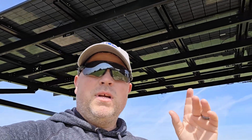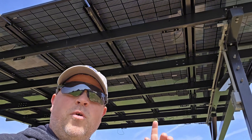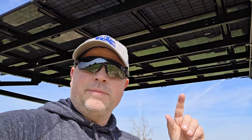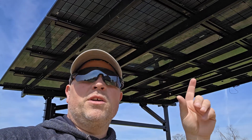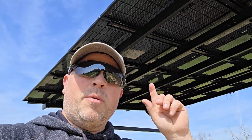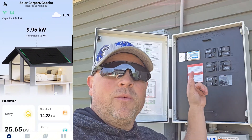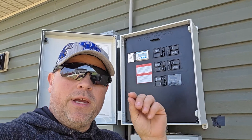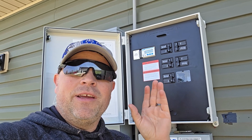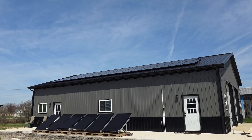This process is still in the works — I'm not 100% complete, I still need to come back and put the bird mesh in and tidy up the wires on the microinverters. But this is what the underside of the solar carport looks like with all the microinverters installed and actually turned on. These solar panels are 415 watts by Sirius Solar, sold from Signature Solar. So far they're performing perfectly — even on a cloudy day I've seen them produce up to 10 kilowatts, which is just over the STC rating of the solar panels, so there's definitely some bifacial gain. Importantly, I'm not seeing any clipping in the microinverters.